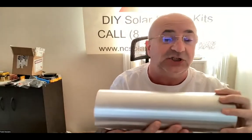Right. Yeah. I'm working on the same thing, but a different kind of thing. No superconductor. There's no superconductors. There's no low temperature problem or anything like that. I've got 10 of these high voltage capacitors, and I'm going to charge them up with the Van de Graaff generator, however slowly that is, to what they can handle. And then those capacitors are attached to this aluminum cylinder, which then becomes ionized. So it becomes very highly charged. The air around it would become ionized as well.